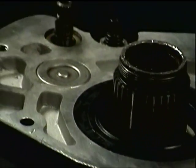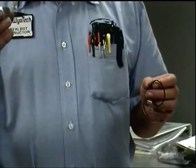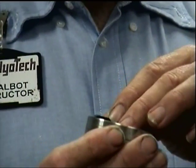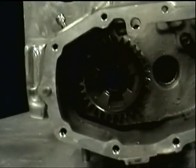This is a quad seal. Can I see the spacer, Paul? This makes a difference which way this goes back together. The chamfer always goes in — the seal sits inside of it. What the seal does is the shaft is round down there; there's no splines. This keeps the oil from coming down the spacer.